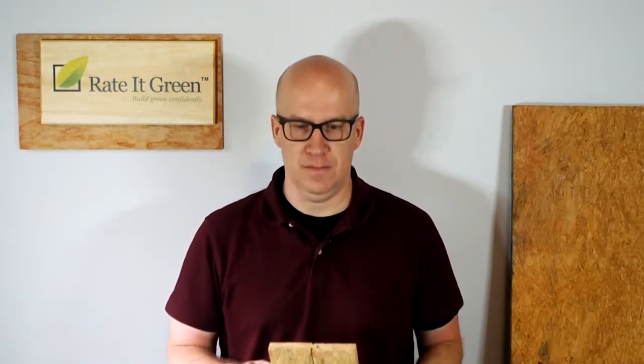The reason I get so excited about this product — and I know it's just a piece of subfloor — is that this is three-quarters inch thick and it stays dimensionally stable. It's a tongue and groove material: you've got the tongue on one side, the groove on the other side. These snap together nicely with a little expansion gap, so it's a good design. But that's not why I get so excited — the fact that this is water resistant is amazing.